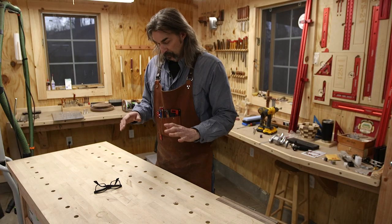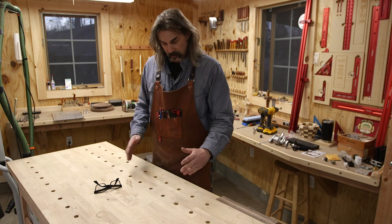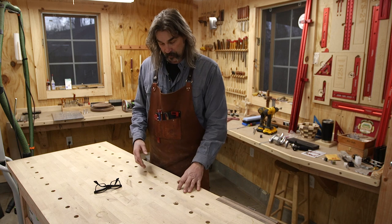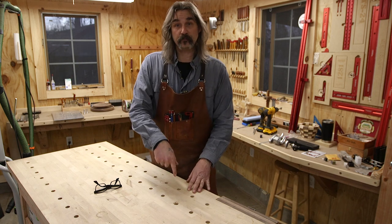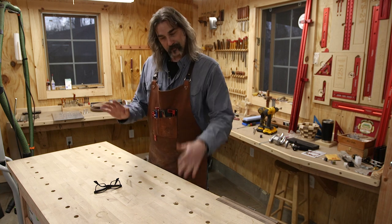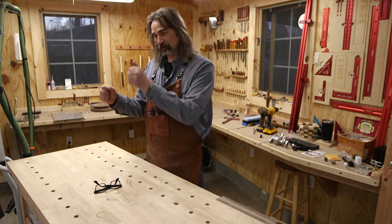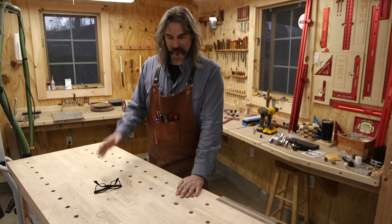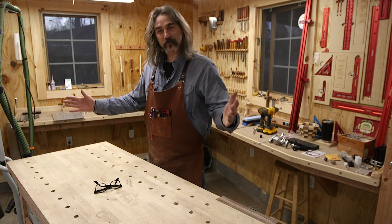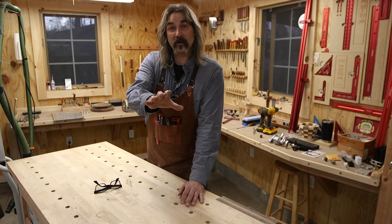Lessons learned: one issue I was having was the holes closest to the edge on both sides — it was hitting my nailer that I built into my cabinet when I originally built this. So I had to finish up and just use a Forstner bit to drill through the whole way. The other thing is patience — just take your time. Make sure you lock the plunger when you've removed the router, that type of stuff, so you don't have any casualties like I did. But yeah, I'm stoked — really excited. Thank you for watching, please make sure to like and subscribe.